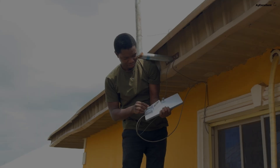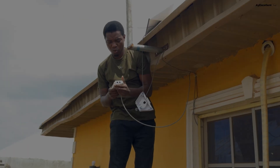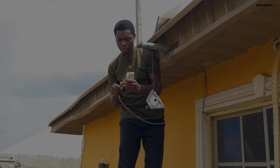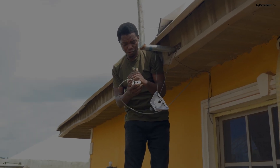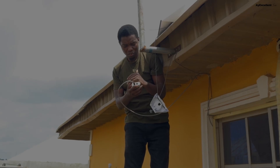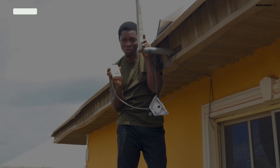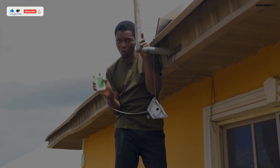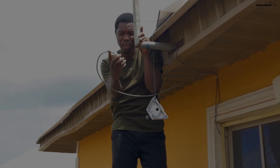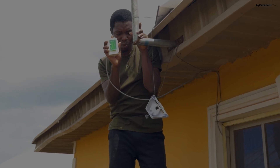We'll remove this and see what we've got here. One of the ways to actually know if the cable you are using is gigabit is the crimping. Let's test — it jumped from one to three, then jumped to six and then jumped to seven. That's the reason why the speed we're getting inside is very slow. Normally you move from one to two to three to four to five to six to seven to eight — then you know your cable is good. That means this cable is problematic.